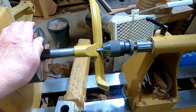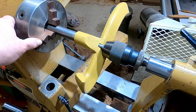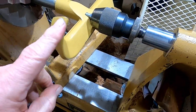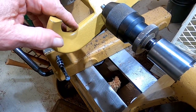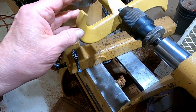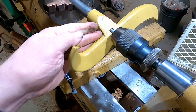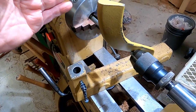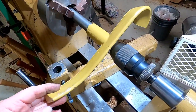Thinking this through, we're going to make some alterations to this setup. There are two things I'm going to do. First, the far end here is much heavier than this end — the center of mass is closer on this side and it may in fact be lighter — but the rotating mass is going to put this out of balance. So I'm going to come up with a means of putting some weight out here to balance it better. Then I'm going to make a disc to mount through a hole here, attached to this, so I won't be in as much danger from this rotating guillotine.